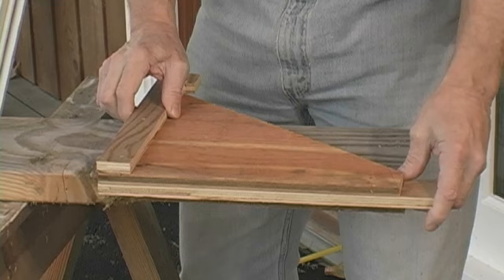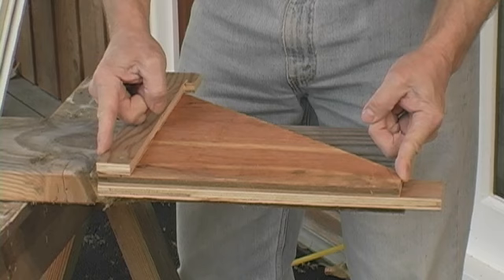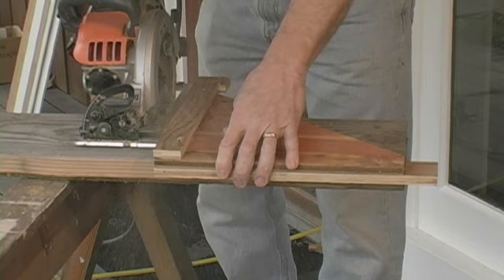I've got my blocking material in place. To use the cutting guide, I placed this hook over the end of the stock. Now this is where your saw is going to run. This is a 13 inch dimension, and because there's an inch and a half between the edge of the saw and the blade, that adds the inch and a half you need for the correct length.